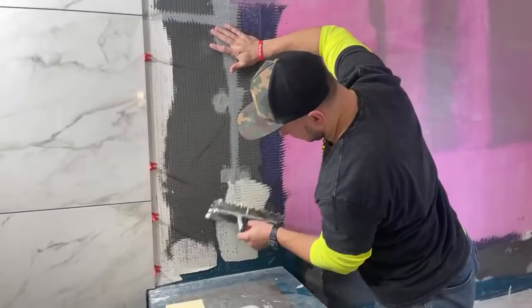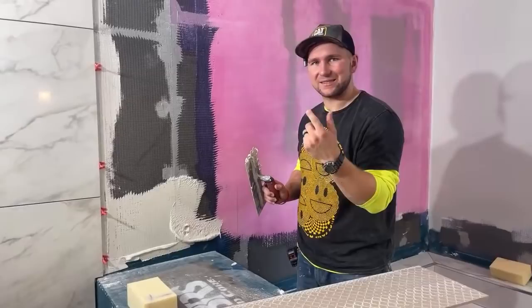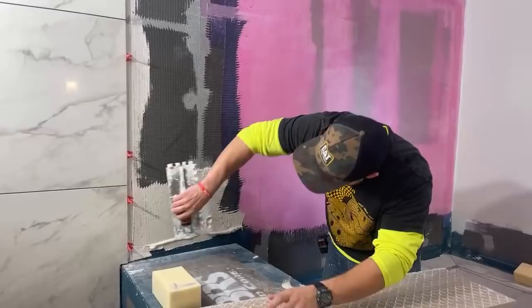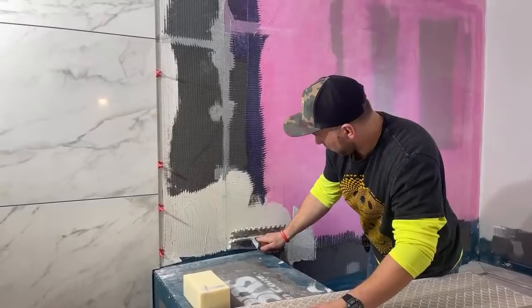Because the issue with that is, first you want to see if the wallpaper is falling off. If it's not, if it's bonded, then you want to make sure that the moisture inside of this doesn't seep through the wallpaper and weaken that glue. I'm just thinking about this, and I feel like that makes sense. So I would definitely RedGard or do the primer stuff.